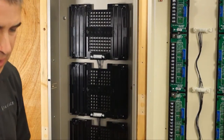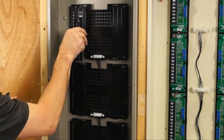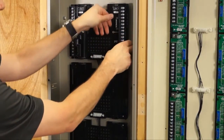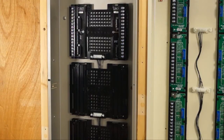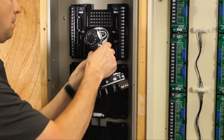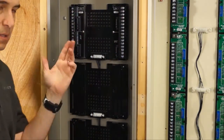The reason that was done is simply that the new module supports more loads, so we had to design new terminal boards for that. As you order your enclosures, you will have to order the terminal boards specific to where you're going to be placing the modules. At this point, just put a couple screws in and that's installed.